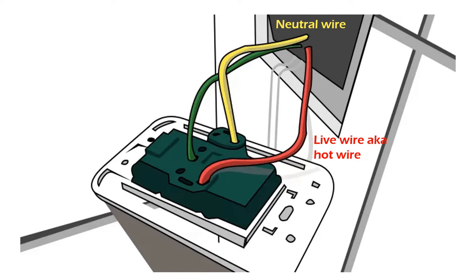The neutral wire is needed for the electrical distribution system to work in your house. The current has to complete a circuit — the neutral wire carries the electricity back to the power source and also directs the current to the ground. The earth wire is for extra protection. You may not be able to find an earth wire in a junction box or receptacle in an older house.